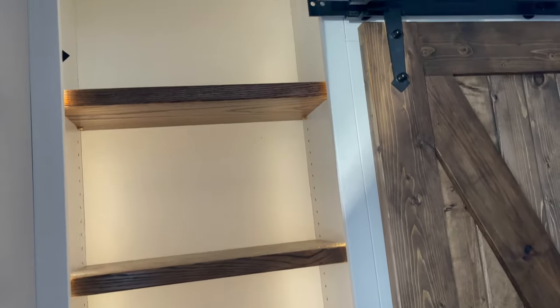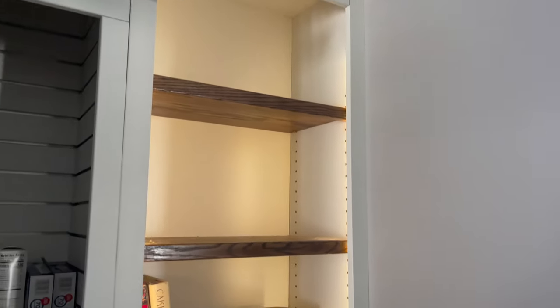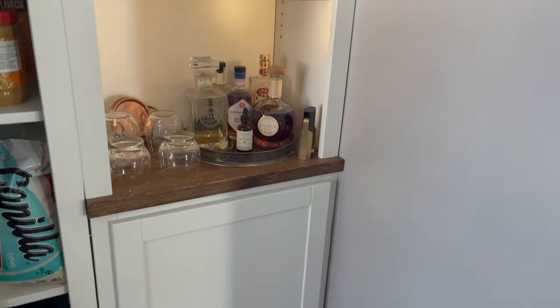There were a couple of challenges we had to face. I had to figure out: if I'm putting a bunch of light strips in and extending them the traditional route — the official way — that would mean buying at least two light strips, one for the left cabinets and one for the right cabinets, and then figuring out how to run them across the tops. I'd probably have to curve them around the corners, which I wouldn't love. I had to figure out how to gap the tops of the bookshelves so they weren't lit up, and then bridge the left side to the right — or split it into two using one controller. Everything I found out there for soldering was focused around the V3 light strip, and not a lot about the newest V4, which has the micro pins that are really close together, making soldering super difficult.